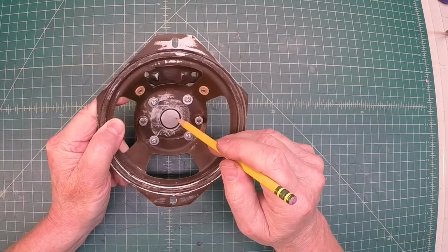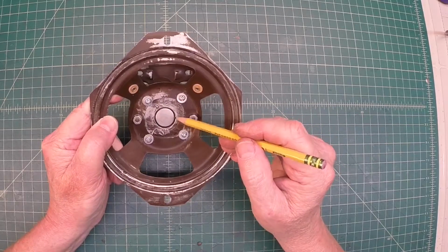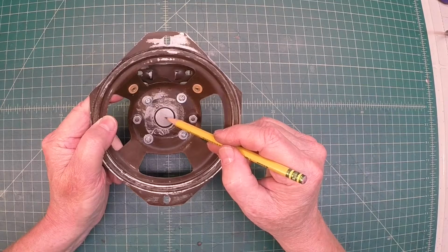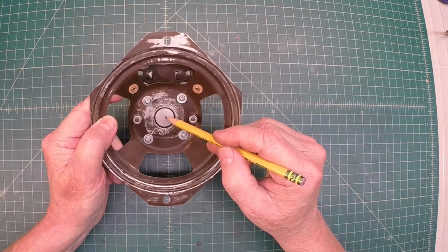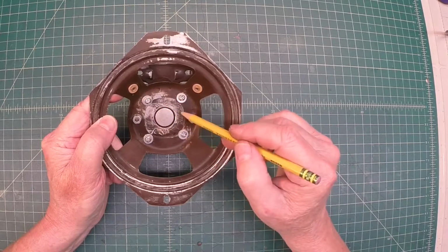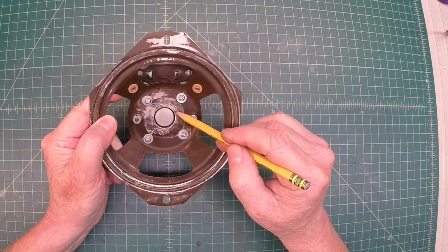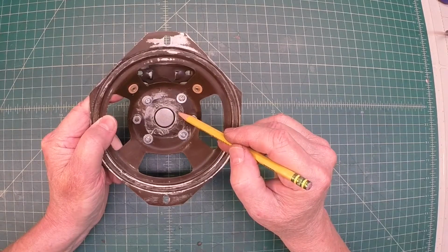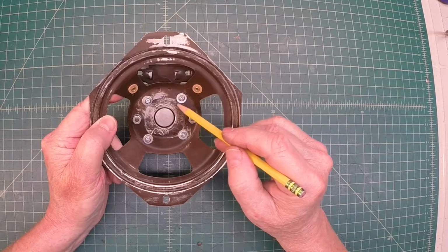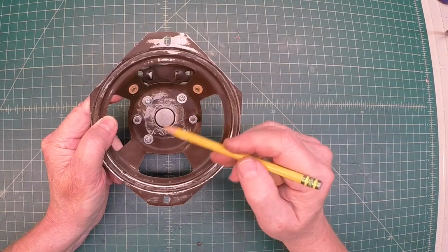There's some alignment that I'll have to do, 2 parts of alignment. First, make sure the center pole piece, and we'll refer to this as the magnet here in the center, will need to be perfectly centered inside that frame area here. And then the second adjustment will make sure that this metal piece here in the background is also in the center of the speaker frame.